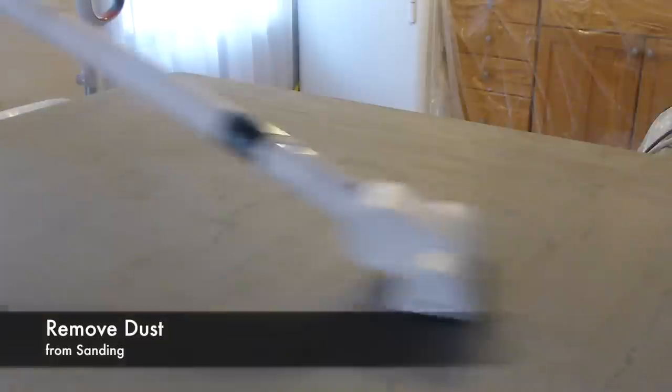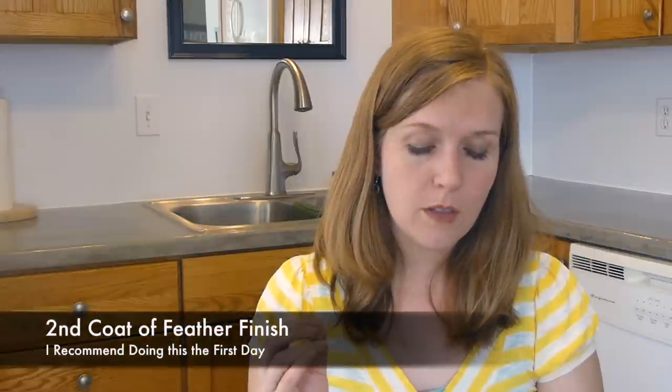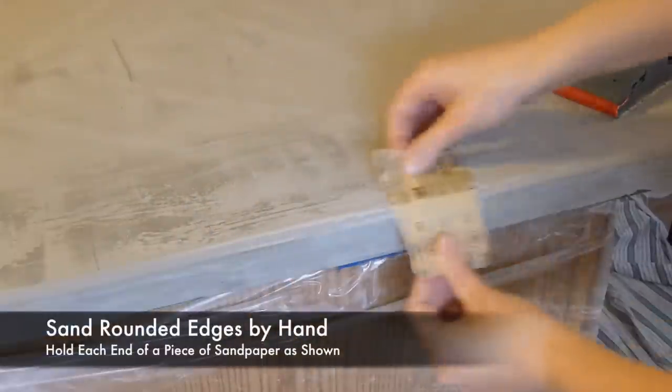In the corners I did a little bit heavier because I had that sharp angle and I wanted it more rounded, so I filled that in with my hands and smoothed it out, and went over it with the trowel a little bit too. We let that dry overnight. I do wish I would have done two coats on the first day instead of just one, but we had our kids with us that day. I did that first coat, let it dry, sanded, removed the dust with a vacuum cleaner, wiped off any excess, and then did another coat. The dry time on the box said two to four hours — I'd only scheduled three hours and after three hours it wasn't completely dry, but it was still fine to sand after about three hours.